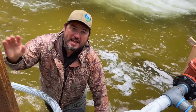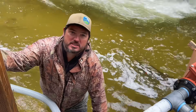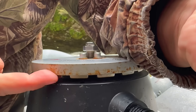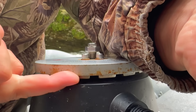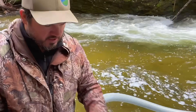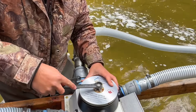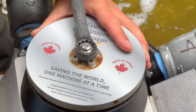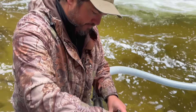10.9 amps at about 55 volts. Now we should optimize — we're going to tweak the level of the rotor. You see this gap right here? That gap can be raised or lowered and that adjusts the voltage. It's like a fine-tune. So we're going to do one quarter turn.